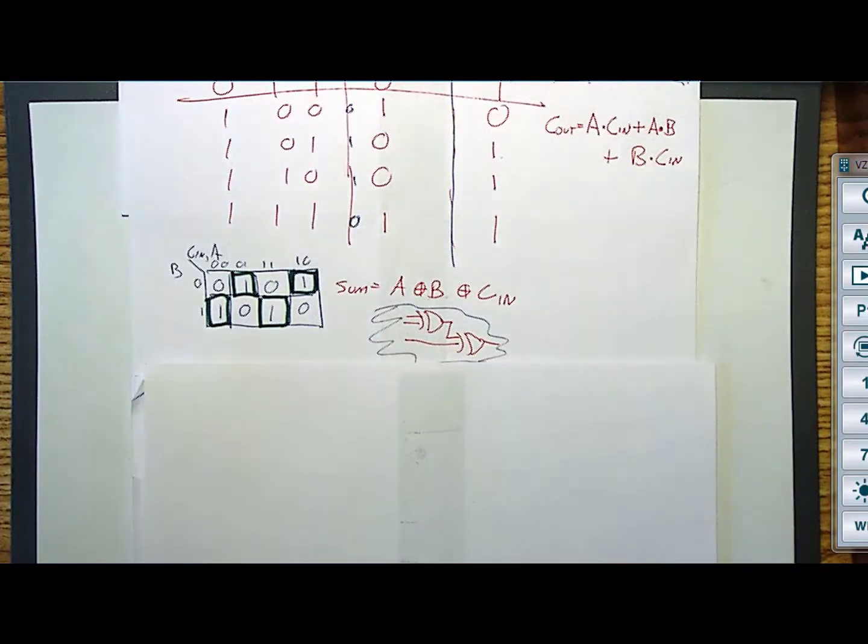But I would like to try to reuse logic operations. This is the whole idea in digital systems of design reuse. It's the principle that if you can break something down into something that you design once, lay it out, build it, and then use it over and over, that's very effective in terms of engineering and also understanding how the thing works. Sometimes you might take a circuit or a logic expression, manipulate it and rearrange the terms in order to use something that already exists. And when you do that, it might actually be slower, but you went for the design reuse over everything else.